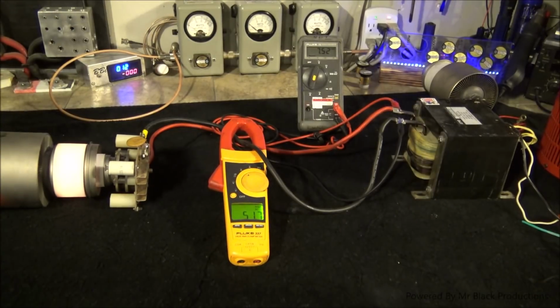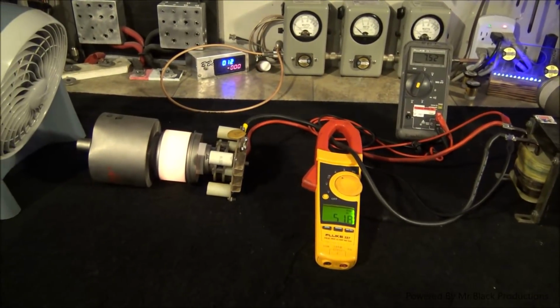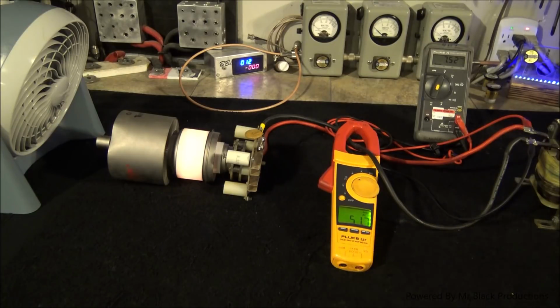What I wanted to show you is this tube is actually glowing. What you're looking for is a soft white paint. You see that? You see how that tube is glowing? That's the filament lighting up on the inside of the tube doing its job. Now, with some quick math we can tell you how many watts the little light bulb on the inside of that tube is. But what we're looking for is that this doesn't change. I've heated up tubes before and this actually started to turn gray and then went dark.